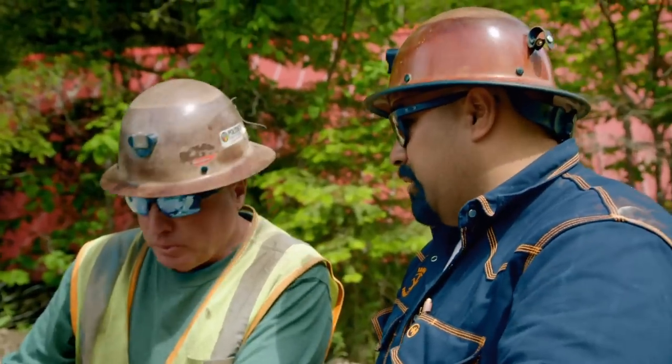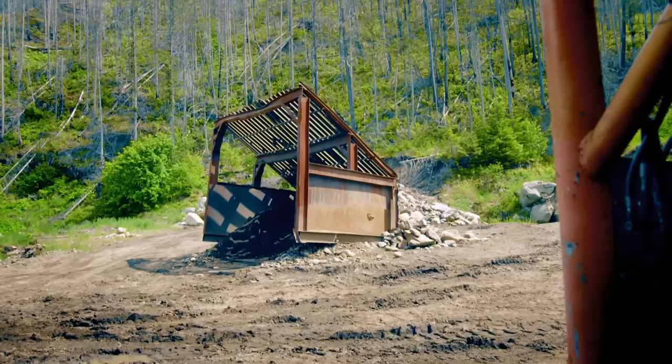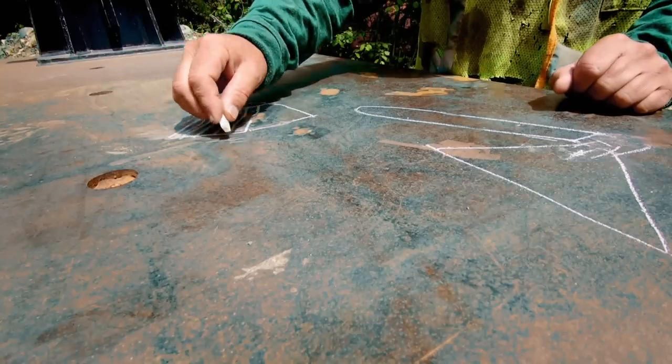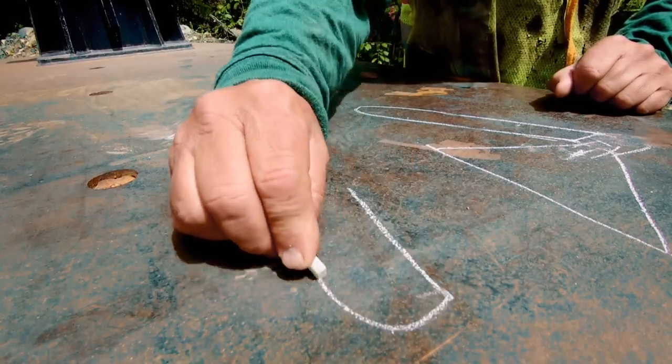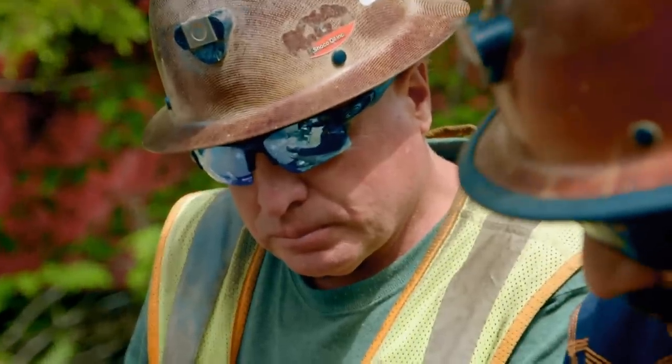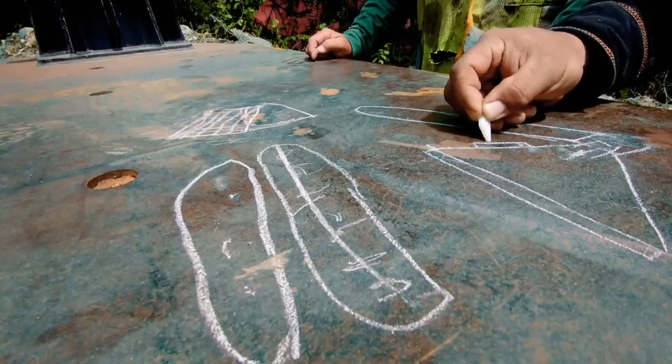The material he's running is super sticky. He's got that static grizzly over there, and the material he's putting through there, it's in the shade. So we take the material out from under there and windrow it and spread it out. What about on his hopper here — maybe putting a little vibrator to help that material vibrate down?